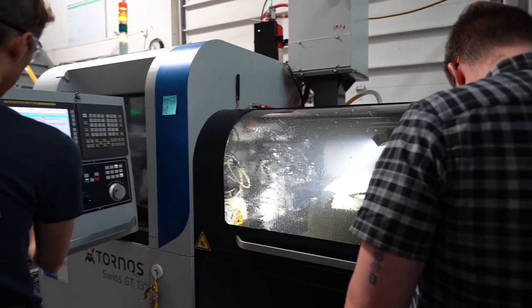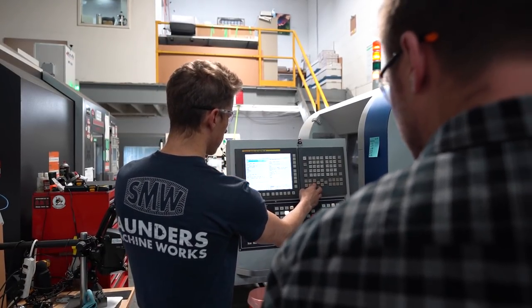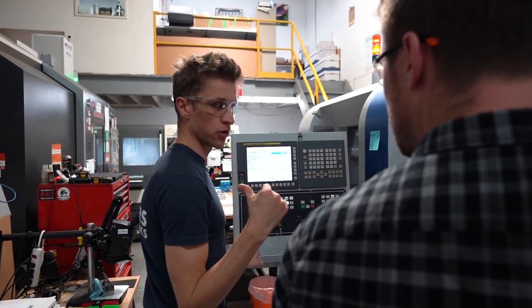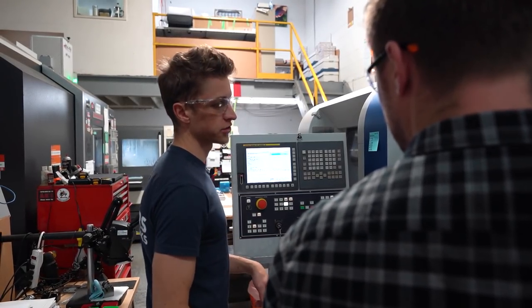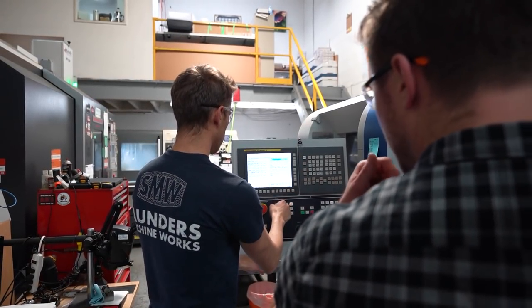But if, so it's got two channels of code, right? Main spindle, sub spindle, and they are physically different. You can adjust right at the panel as well. Yeah. So I will make adjustments here, but I like my computer code to match exactly. So if I make an adjustment here, I'll walk over there and change it. Or I'll change it only over there, bring it over here with the USB stick, and they gotta match, right? Otherwise you're asking for trouble.